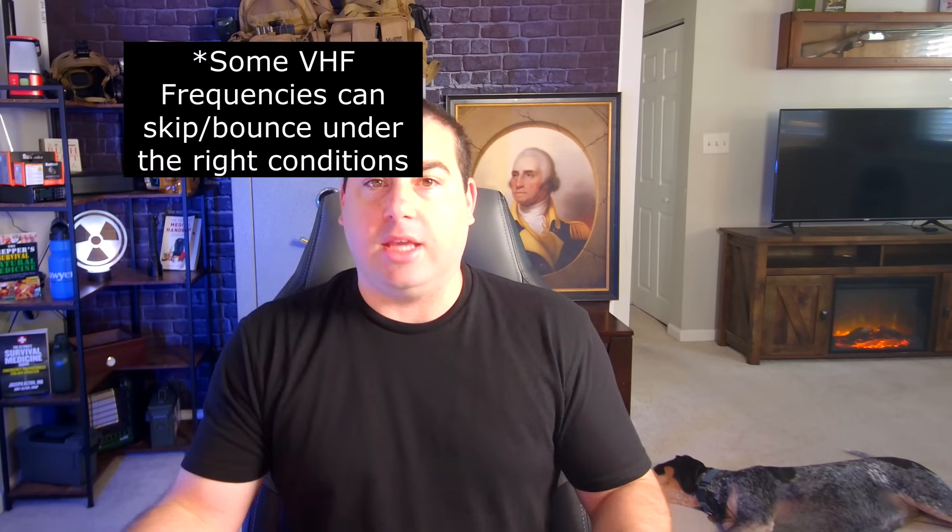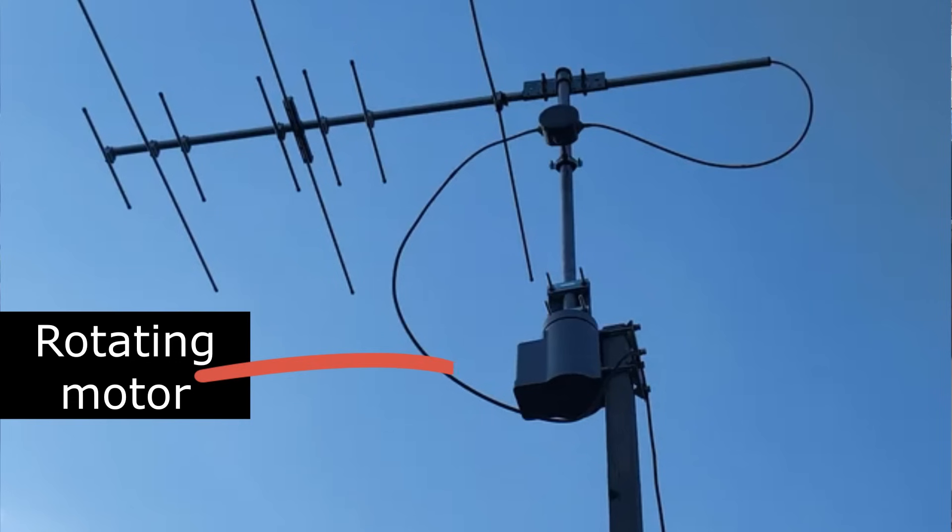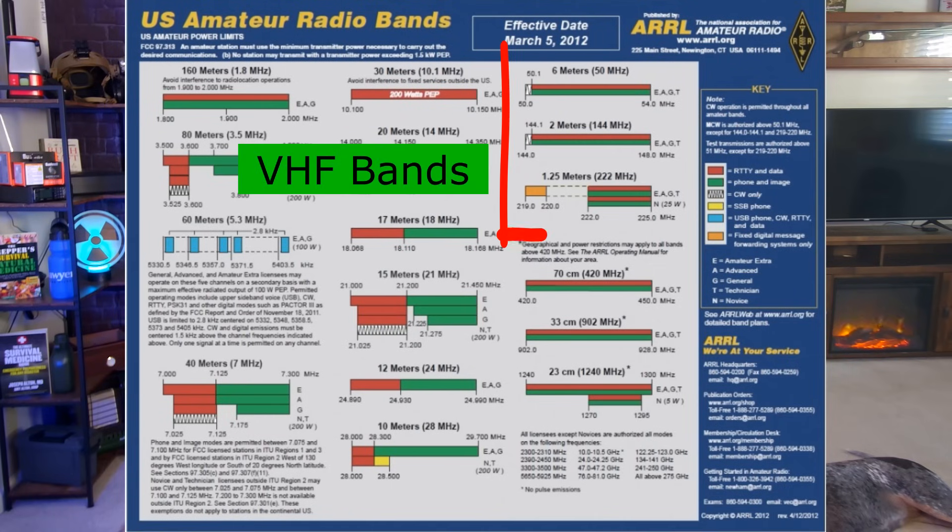VHF and UHF signals don't bounce. They get absorbed when they hit things — when they go through drywall, a window, through tree branches and leaves — they get absorbed, but they will keep moving just at a weaker pace. HAM radio operators using HF bands have special antenna setups where they can point their bands to the sky to bounce them around and aim them where they want to go. This requires special radios and extra equipment, so it can get super expensive for someone just looking to get into a good radio system. Let's move into VHF — this is typically line-of-sight propagation, with the exception of the six meter band.